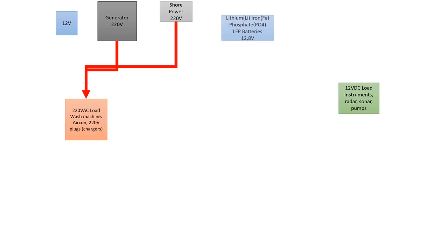There's also a DC system. The DC system runs off the battery system — 12 volt direct current, not alternating current. So the boat has two systems: the 220 volt AC and the DC system. The DC system is mainly run from the batteries, and in our case from the start we're going to switch over to lithium batteries.